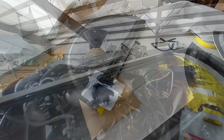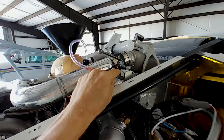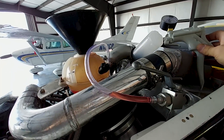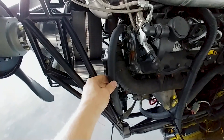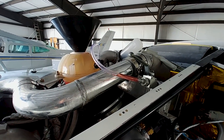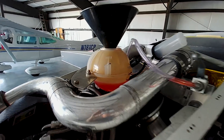Now we're on to Monday and I wanted to figure out this problem with the coolant overheating. I've put a valve here on the top of the radiator - fortunately we had an old inlet there - and I managed to vacuum all the air out of the whole system. There was a lot in the radiator; I think I put almost another gallon of coolant in with all the air that came out. You can see now when I squeeze the hoses it basically makes that move, so I think all the air is out. I shut that valve and I'm going to leave it there so I can bleed it anytime I want.